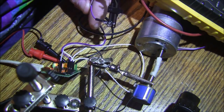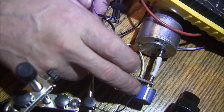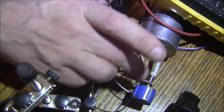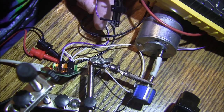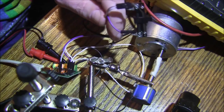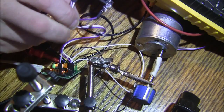I've done this a little differently here to illustrate the point better. I've replaced the linear pot that will actually be in the system with a 10-turn pot. This represents the motor turning the lead screw and getting feedback off the pot directly through a 10-to-1 ratio — which is what my lead screw is: one turn moves a hundred thousandths. So this represents one inch of travel on the compound, and this linear pot will be connected up to the stylus that traces on the pattern.